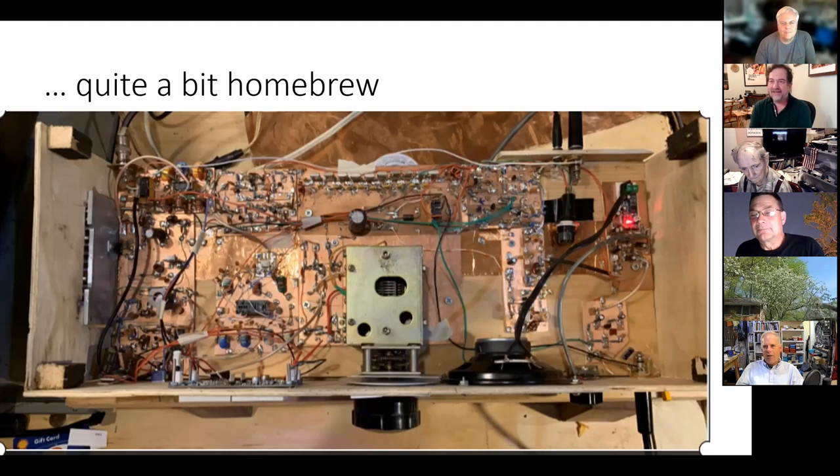I have over time been tempted occasionally to try to put AGC in my rigs. I never have. I may do it one day, because I recognize that it helps with the ability to handle large signals. It helps with the dynamic range of the receiver. But it adds a level of complexity that I don't think is really necessary. So I'm sticking with Farhan on this one. When he goes AGC, I'll go AGC with him. It only takes two transistors, Bill. Or an op amp and a FET.